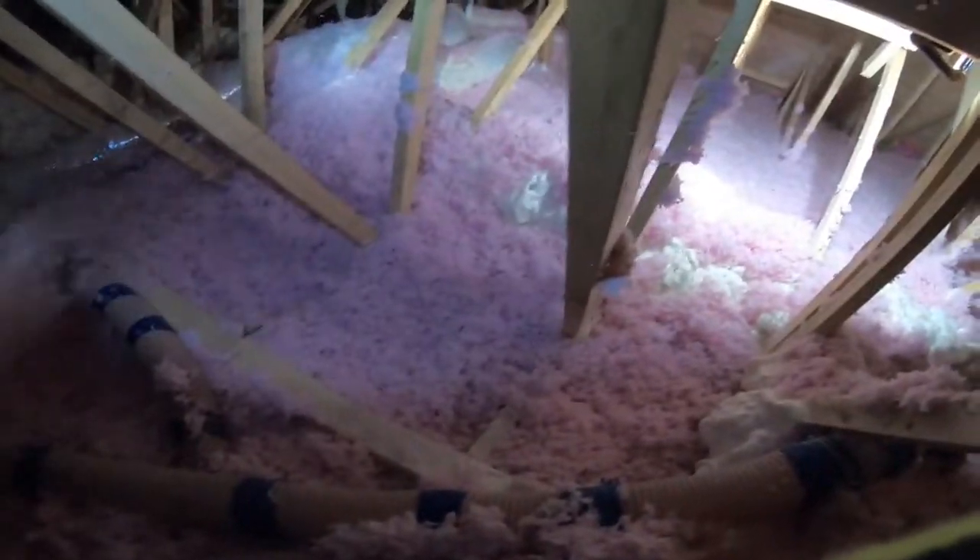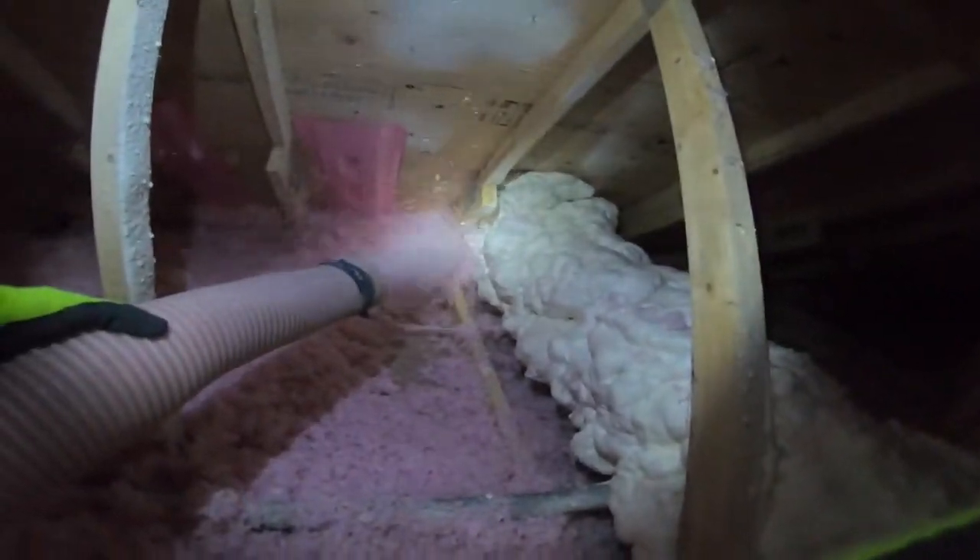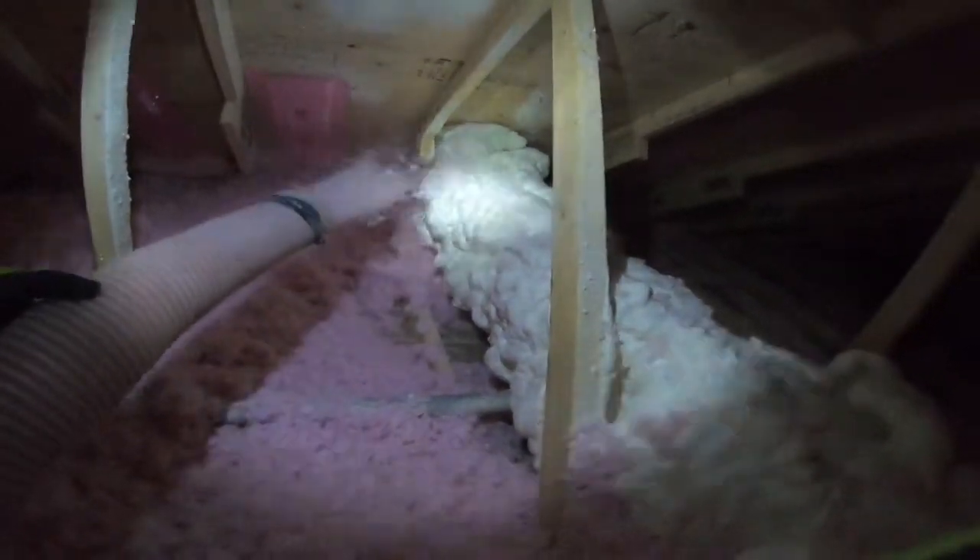For these heat runs I cannot step on them or else I'm going to damage not only the ducts but the insulation, because this stuff is definitely very fragile. You also see this gap here — I've got to fill that right in, or else there's going to be some thermal bridging, and I want to avoid that. I've got to fill all of this under here, and especially get places like right in that corner over there — you've got to stuff that hose right in there and make sure everything is covered with the loose fill. That's definitely a lot of multitasking with this job.